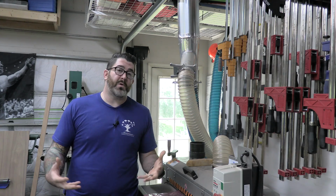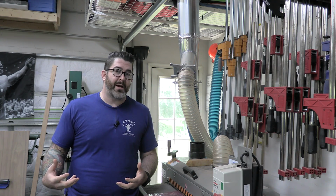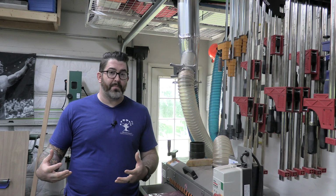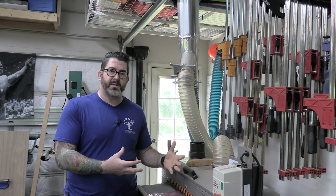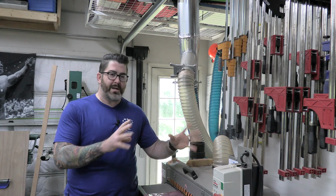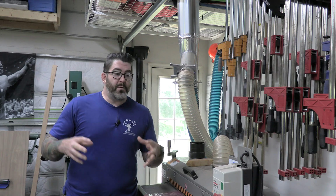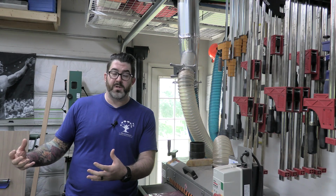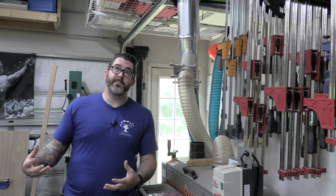Now, I know a lot of folks will go out and get PVC, or they'll just go to their local home center and buy snap together ducting equipment there. The problem is, obviously, there's all sorts of concerns with PVC about grounding, and there's ways you can get around that. Plenty of people do that, have no problem with it. If you buy cheaper or just kind of home center grade metal ducting, that oftentimes is too thin.